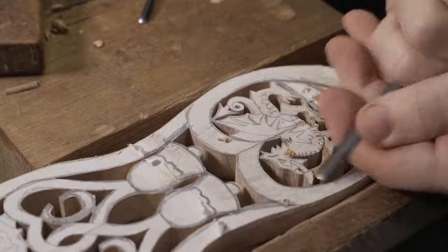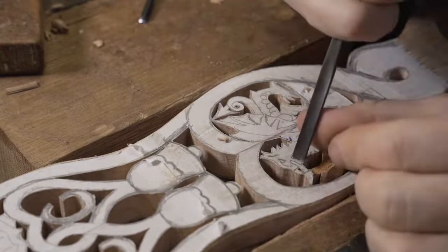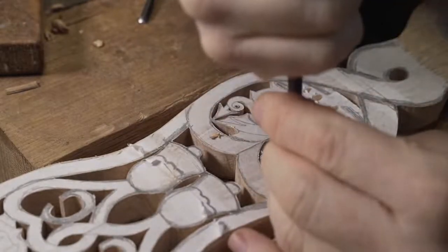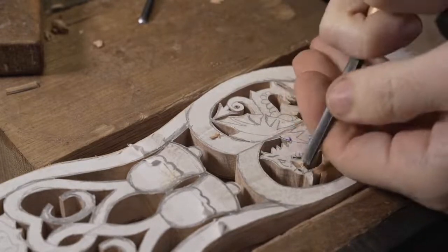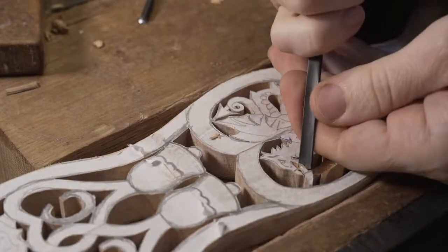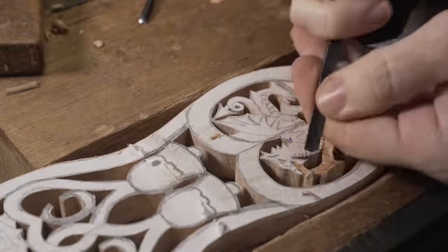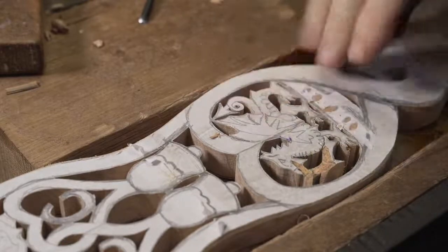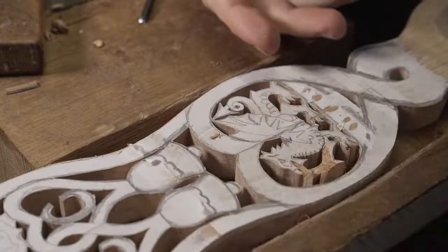We find that because it's reclaimed from furniture, they were quite skilled when it comes to putting together the furniture. The people sticking together the different pieces were very skilled at doing that process, and they do a fantastic job of concealing the joins. So you have to be careful with furniture when you're marking out, because it's very easy to mark out and have two pieces of wood stuck together, and you're halfway through your carving and you've got a bit of a problem.